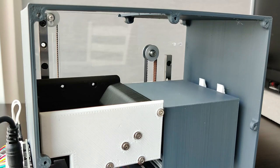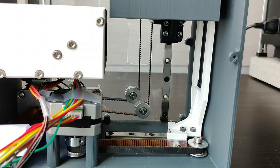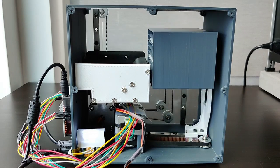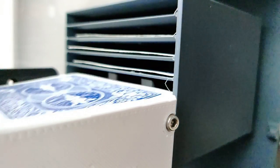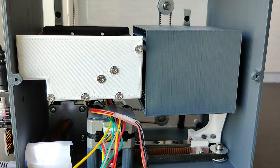So once we dispense enough cards into those 8 bins, they need to be returned back into the original dispensing bin. So this is done using a push bar, which is basically a giant fork that just sweeps horizontally from right to left, and uses those slots cut into the bins to push the cards back from the bins to the dispenser. One bin at a time, they're returned from the bottom up to ensure the push bar doesn't do this.